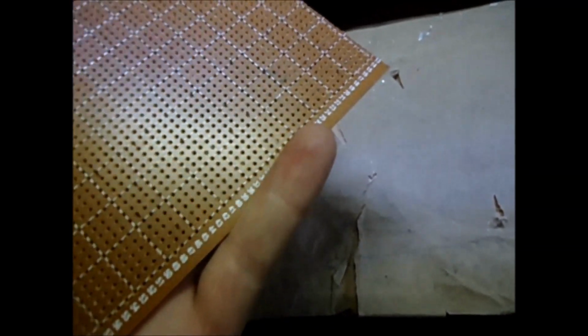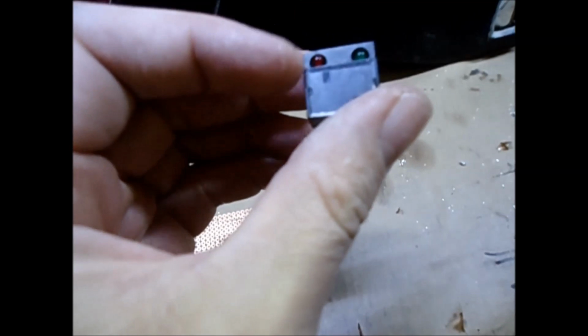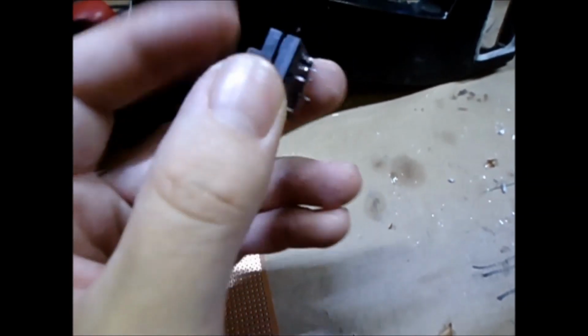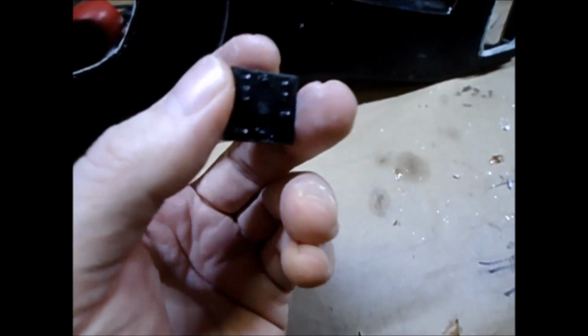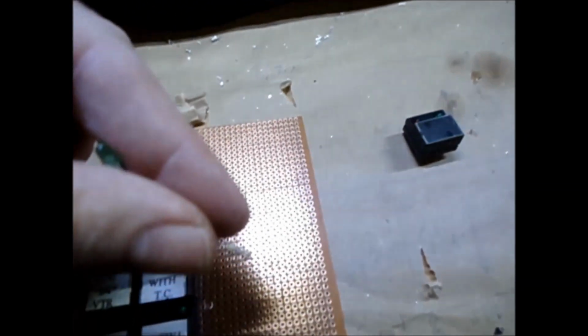It's been a while since I soldered one of these. Over a decade. So, switches, I think they're pretty simple. It's just got three legs on it and then the legs for the LEDs. So what I usually do is run the red and yellow on all the time and leave the green one where it goes on only when pressed. So you got to figure out how you want to solder these. And you got to use resistors on those LEDs on the negative or the positive side. Yeah, little resistors like that.